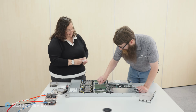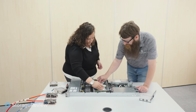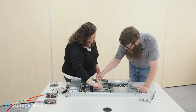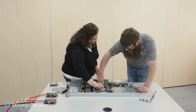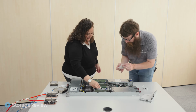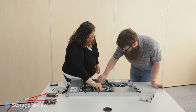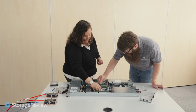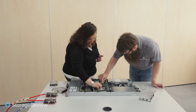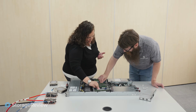Talk to me a little bit about the leak concept. If a leak does develop, you'd be able to detect that in some way? Yeah, let's talk about two different kinds of leaks. One is a small leak that you can't see with your eye. It could be happening little by little. What would happen is the pump will keep pumping liquid inside, and the liquid level in the buffer will slowly go down. So the system alerts you for that.